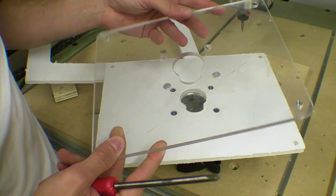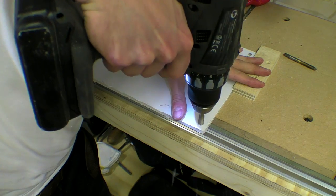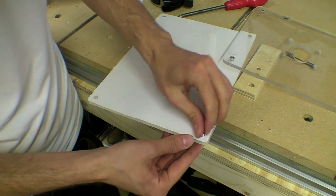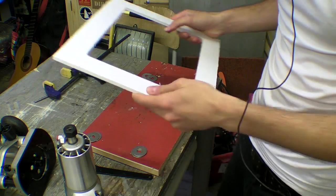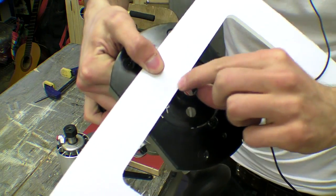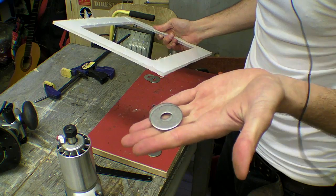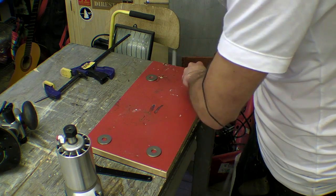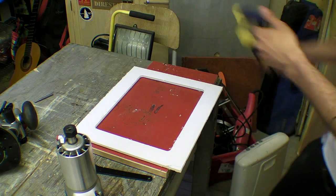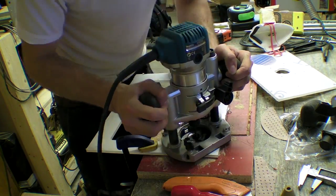This means I'm going to send my old one to Francesco and keep the new one. So I'm just going to test the template out before I send it. This is the bushing on the Makita plunge base — it's a little bit deep, about 2mm. So I'm going to use these two washers, probably about 1.5mm each so combined will be 3mm, just to give me that added height. I checked the bit was centred in the bushing using a hardwood homemade centring cone, then routed only three faces of the template.